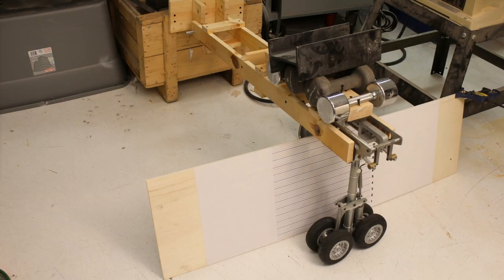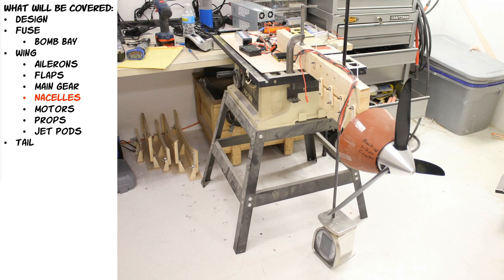I did my load testing and drop testing — there's a bunch of weights, barbells, and a big piece of I-beam. I had about a 48-inch moment arm and would drop it from 14 inches. I did a lot of testing of my carbon fiber design where I'd replaced everything that came with stainless steel — I was super excited. The next video in this series is going to cover the nacelles, including an amazing amount of testing, mock-ups, cowlings, and air cooling.